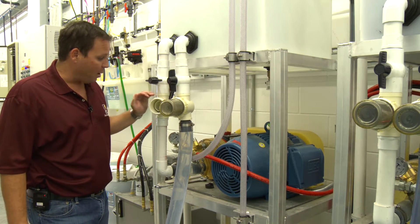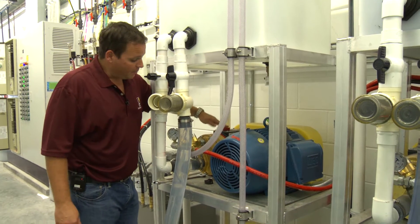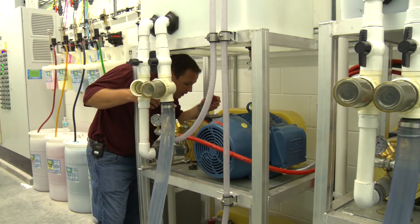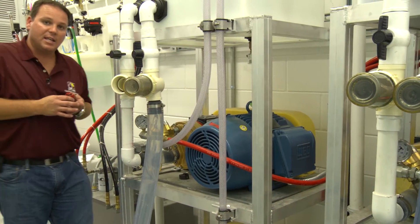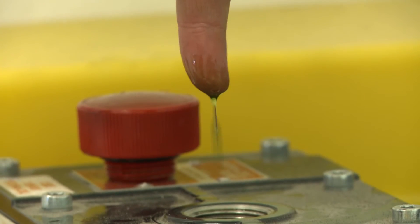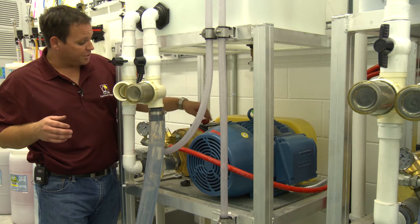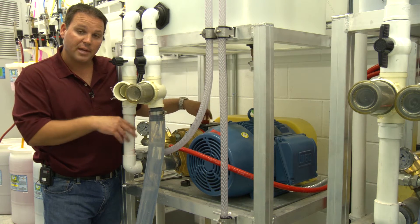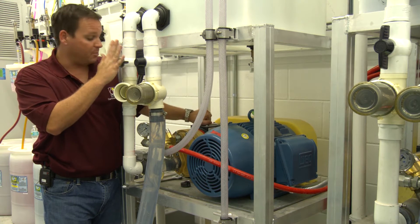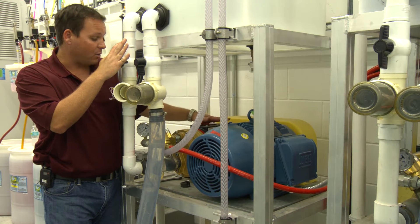Weekly, we have to check the pump level. You can check the pump level two ways. One, if the pump's up high like this one, you can open it up, stick your head in, and look in to see the level of the lubricant. If you can't see the level, the other way is by taking your finger, sticking it down inside, and making sure there is fluid inside the unit. These H25 pumps will give you years of trouble-free service as long as they have two things: plenty of water being fed from the water source — if they run dry, they like to cavitate, which can cause severe damage — and plenty of oil.